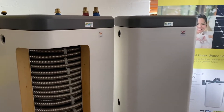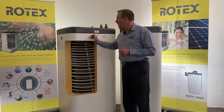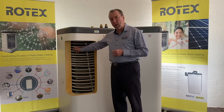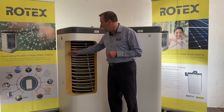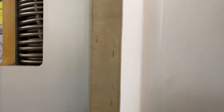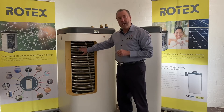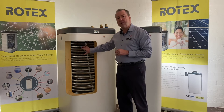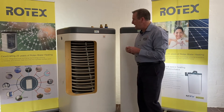So looking at what makes up our thermal storage tank. Firstly, we've got a polypropylene outer and inner casing, hard-wearing polypropylene. Inside, that is our polyethylene foam insulation, 90mm thickness, which maintains the heat energy that we control in the tank. The energy in the tank is based on mains water that is unpressurised in that vessel, either in a 500 litre capacity or a 300 litre capacity.